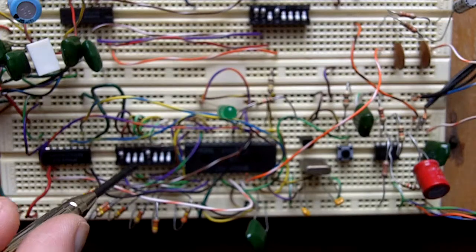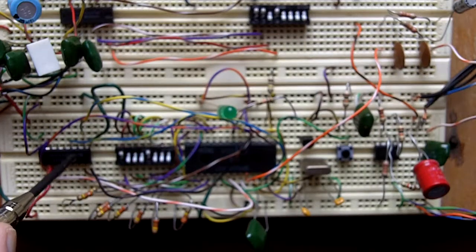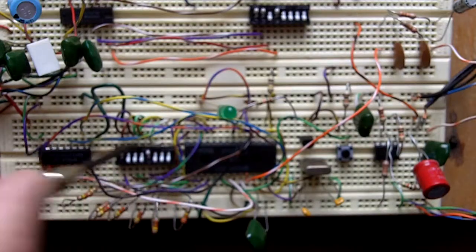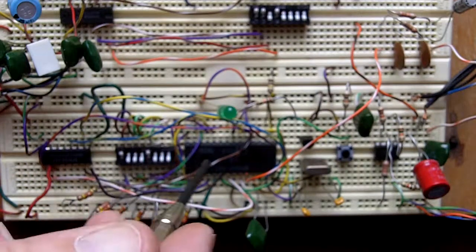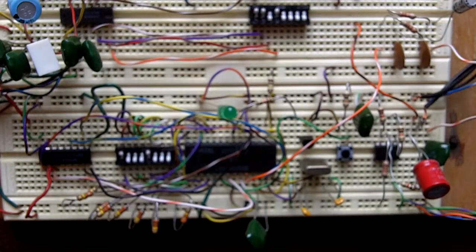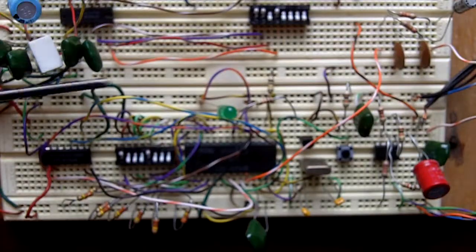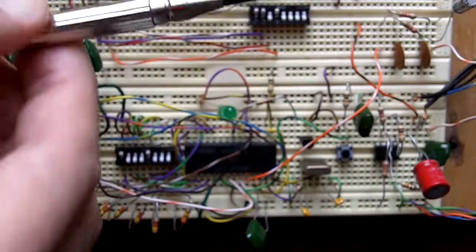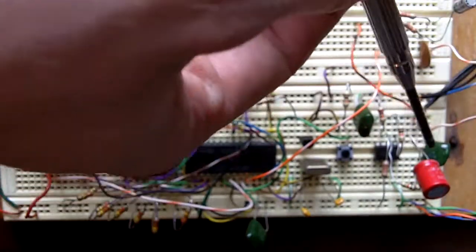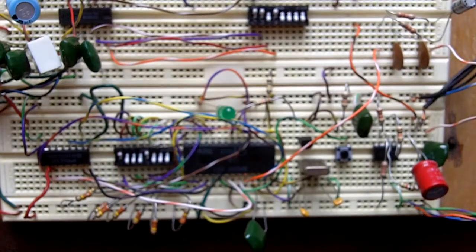This is a little switch where I can tell it which word to speak. The ROM has extra phrases. These two were sold by Radio Shack and they were sort of set up for a clock. So the chip itself has a ROM that can say the words 0 through 10, and then the ROM has extra stuff like hours and seconds and a few melodies. The circuit itself is this part of the breadboard. This little bit up here is a filter before it goes into an op-amp to amplify the sound a little bit, and it's still pretty soft going through a speaker using 5 volts.